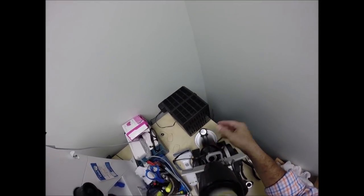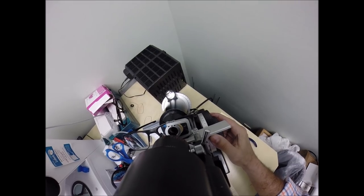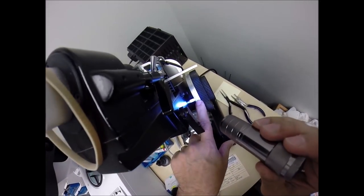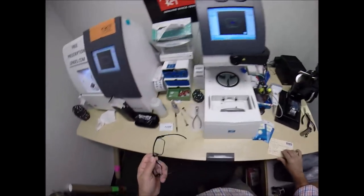Doing a final inspection on the lens. Check the power, and I don't even have to move anything. It's still at minus one. Let's check your second curvature, and we're at minus 175, one tick mark away from two. So I couldn't have done any better if I'd cut these lenses myself.